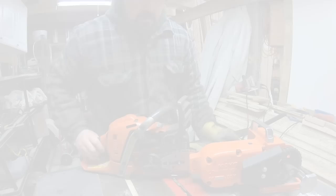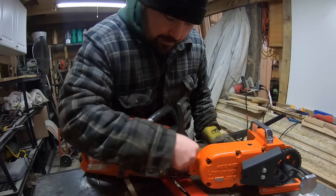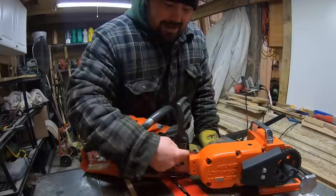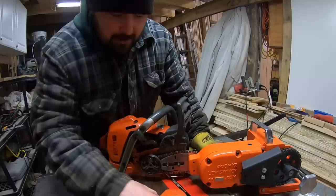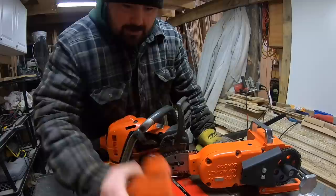I just took a little break. What I was doing was I had everything buttoned up, put on the cover, and was tensioning the chain. Despite tightening the screw as far as I could — the one that moves the bar forward and back — the chain was still loose. So I realized I had to take out a link on the chain. The chain is now one link less. If you have a Husqvarna 555, just keep that in mind — you might have to take a link out. I also went ahead and added Loctite to all the nuts and bolts that needed it, so we should be good to go.